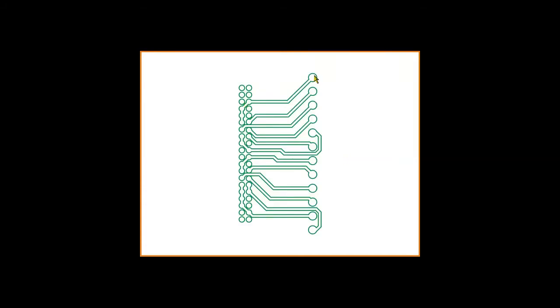and here I've just gone around those lines with a 0.5mm contour and made a couple of adjustments here and here, just so that I can get this trace going through the pins. And these are the drill hole locations, 0.8 for the IDC header and 1mm for the screw down terminals.